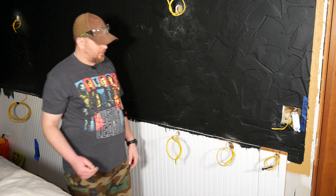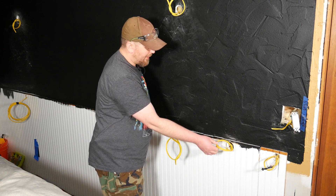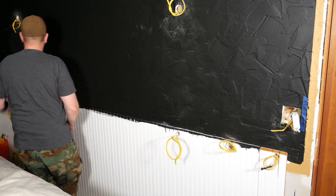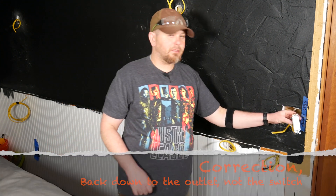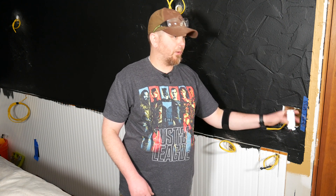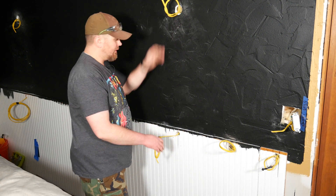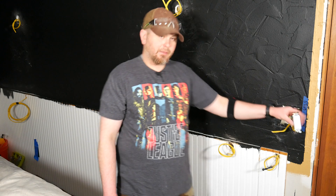The way this is going to work: we'll tap into power down at the electrical outlet, send hot up to the switch, then back down and up to each light, and send neutral back to each light and back down to the switch. So the switch location carries a hot leg and the switch breaks that line, getting its neutral feed back down at the electrical outlet. The key takeaway is you need wires at each location and enough wire to bring them back to this general area where we're tapping into power and connecting the light switch.